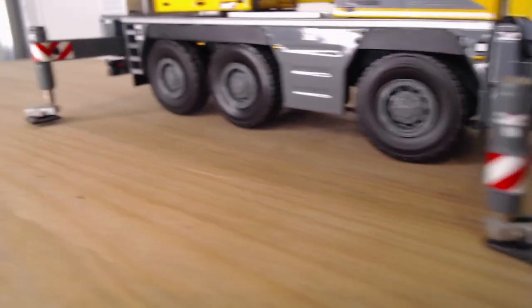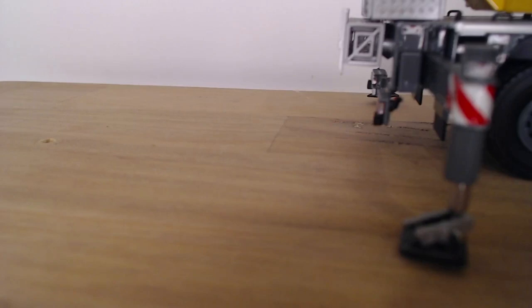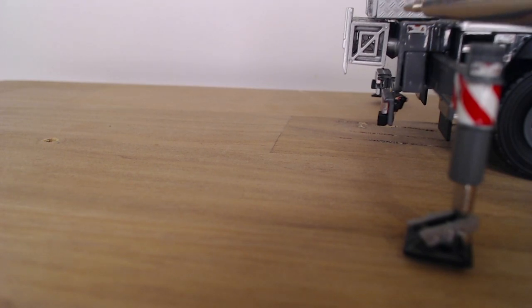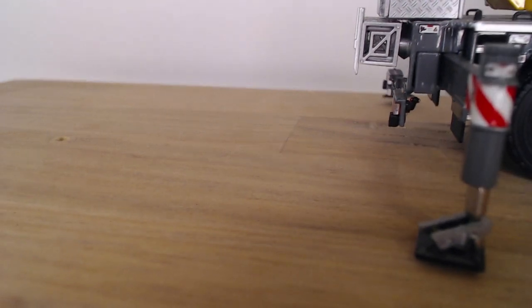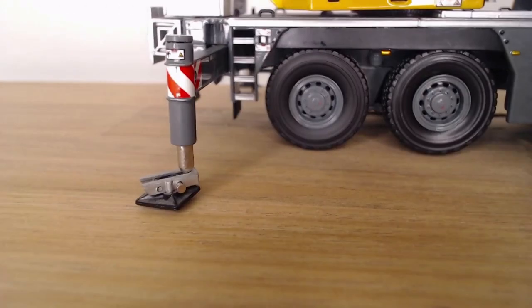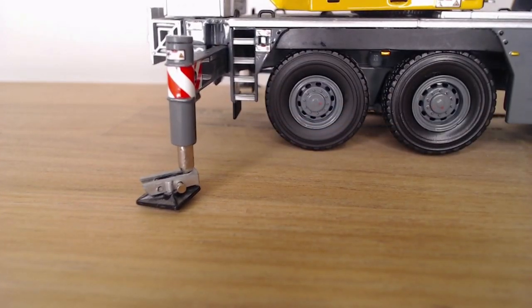Another thing you can do is you just start going around to the back here, and start pulling timbers out of the timber box. You're going to have at least three for each outrigger. So I just smash out six, bang, bang, bang, out on the ground, grabbing two at a time, taking them down to the front, then grab the third one, and put outrigger pads down underneath that. Now you can do all this while he's on the other side pushing his side out and going around and taking out the pins on his side as well.